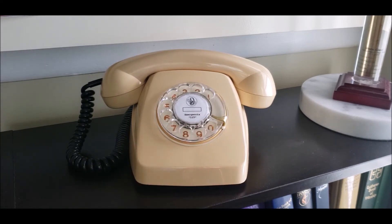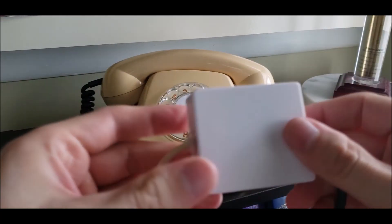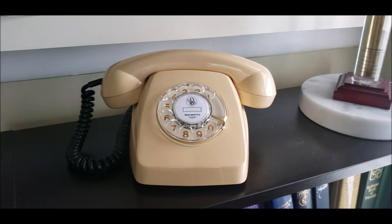The concept is pretty much the same as on the Princess dials — you've got the golden finger stop and the way the bezel is mounted. There's a retainer ring that you turn clockwise to put it under the notches, securing the bezel on the dial chassis. I also managed to keep the original line cord and mounted a small box with an RJ11 port so I can plug it in and test it. In the next video we'll be testing it out, showing that the dial works and that the ringer works as well.